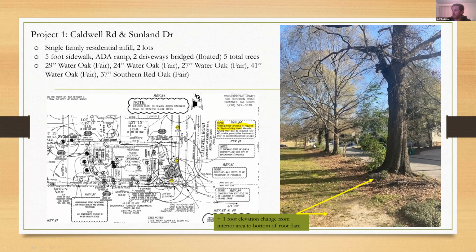And knowing that we were going to meander the sidewalk from the corner here down to the corner out of sight behind the trees, the builder felt like they would have to do zero cut grading, and if he could bring in a certain amount of fill just to level things out, and then get started on the base aggregate layer for pouring the concrete, it would probably be a viable option and actually get his grade the way he wanted it for his driveways to the frontages of the 2 homes. So that particular site variable kind of played in our favor as well.